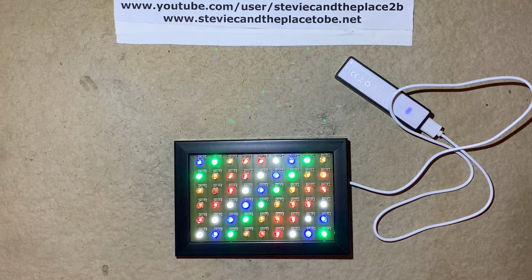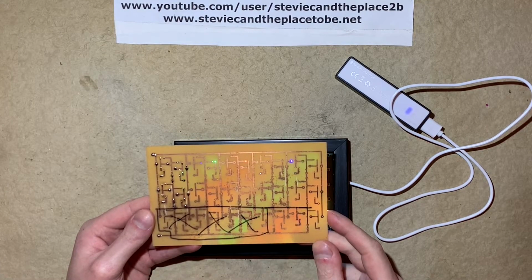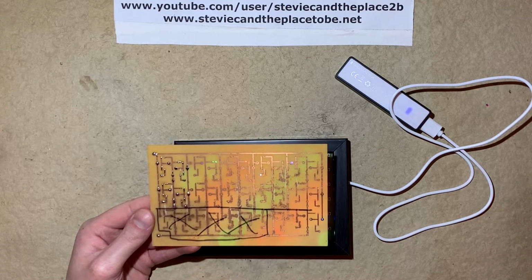I've been assembling another of Big Clive's Gallium PCBs, this time with flickering LEDs. But I thought I'd give you a break from those by making another of my own boards. As you can see, I'm still needing the practice. I think I may have overexposed this one. The overexposure has left too much photoresist, which in turn has left too much copper surrounding the tracks. So here's hoping I'll do better this time.